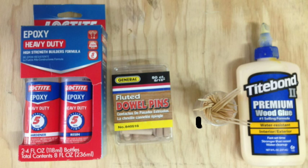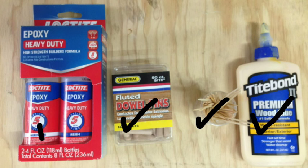We're going to show you a way to fix it using three or four different materials — toothpicks, wooden dowels, regular carpenter's wood glue, or a quick-dry epoxy. In this demonstration we're going to use both the toothpicks and the wooden dowels, but we're going to use the quick-dry epoxy because you don't even have to take the door off to use this material, and it'll dry real quick so you can get it all put back together and working usually within an hour.